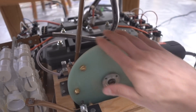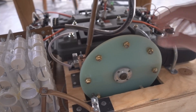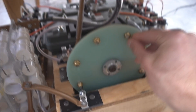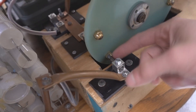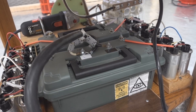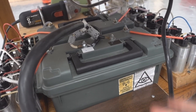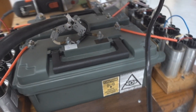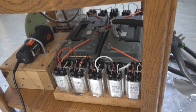The biggest problem to tackle was this Rotary Spark Gap. I'm still using an angle grinder, but the original design kept burning up electrodes and just was not firing consistently. So I started by having this custom machined Bakelite disc made for me, that holds these little flying electrodes really precisely, because my original hand-drilled one just wasn't cutting it. I also replaced these static electrodes with tungsten rods — these things last much, much longer, and I'm getting way better results. I rewired the main supply to run on a 240-volt split phase outlet. The main supply is still just four microwave oven transformers chained together in series, but I did add a lot more ballast caps — about 20 microwave oven capacitors — which functions as a power limiter, so in theory this power supply shouldn't draw more than 5 kilowatts. Let's make some sparks.